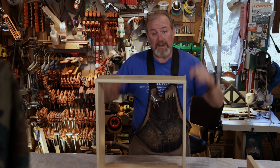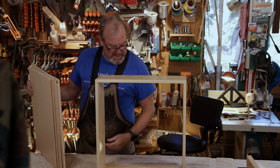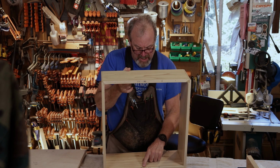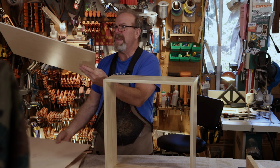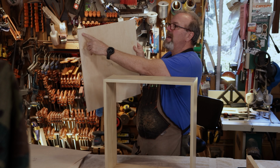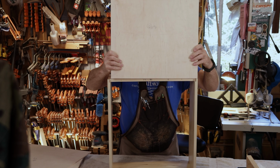Now we're going to put the pre-finished bottoms in and assemble them. So these are all the bottoms right here, and everything is labeled. I label all of my drawers right here. So this is the drawer. This is the front of the drawer on the very bottom. This one says R stove mid. So we're going to come over here and look for these. This is R stove bottom. This says R stove mid. This is the bottom that's going in here. It has the label right on the very bottom, and I can tell what side is what because it has 3 screw holes in here, which get screwed into this back. Those 3 holes there will match up with these guys right here.